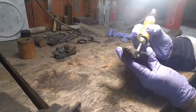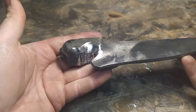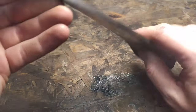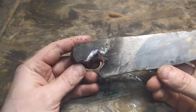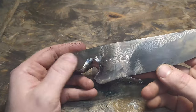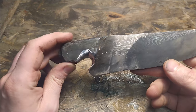Unfortunately, I don't have a milling machine, but I can use carbide bits and mill the bolster by hand. This took way too long, so I'm going to normalize and anneal this piece because it is a little bit too hard. Then I make the second side, which right now is untouched.